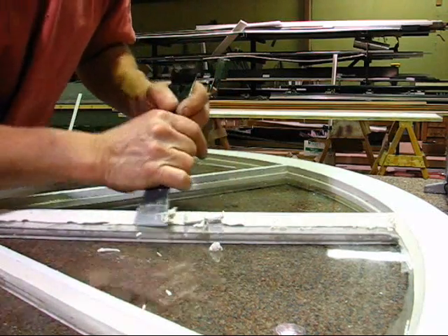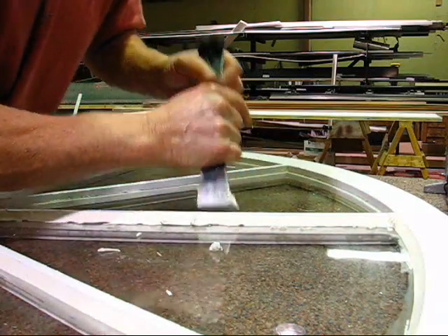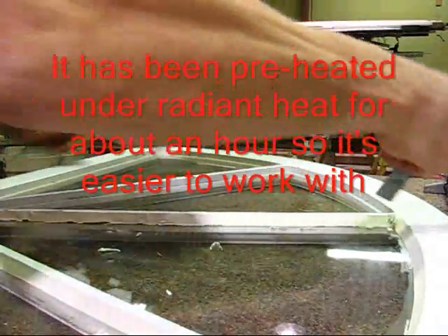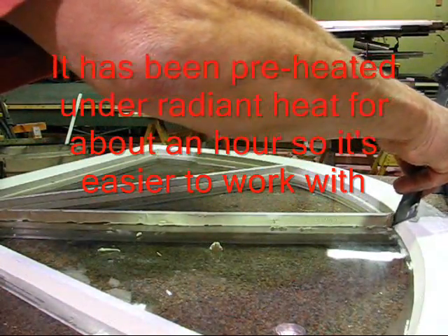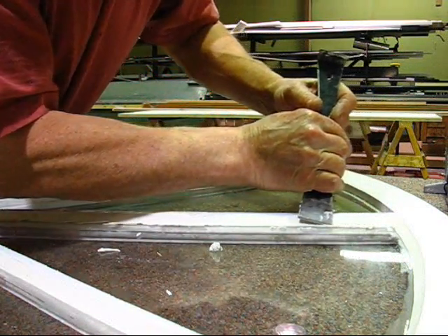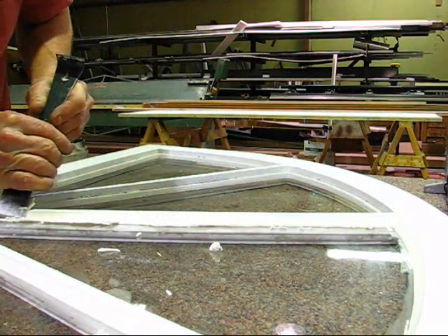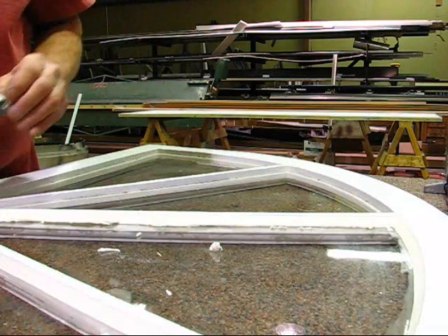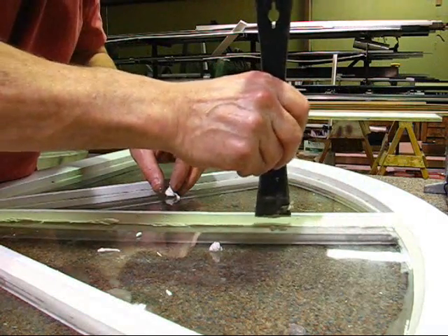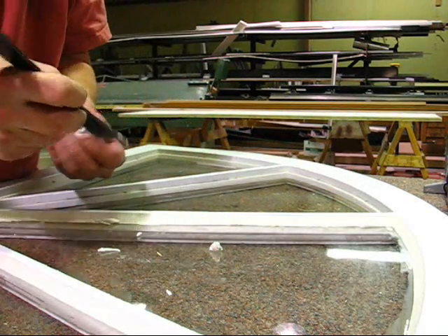A little more material. Once you get this straightened on there nice — it's a fancy little custom bar, that same bar that you were using to scrape all that paint off. You can run that down there like that. Looks good, but too much stuff on there though. I like to thin it out and work the glazing stick. You can see it when you put it on a little bit too heavy.